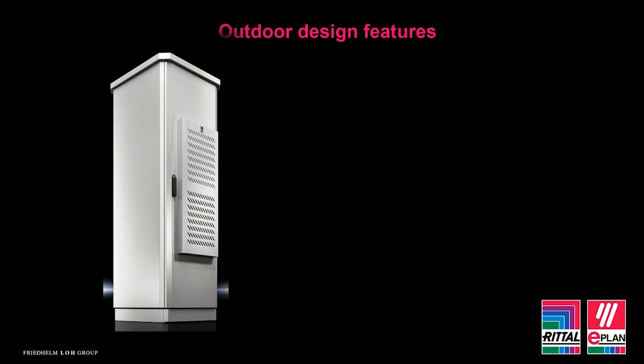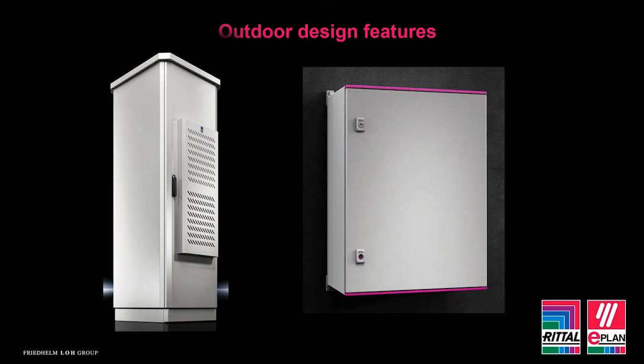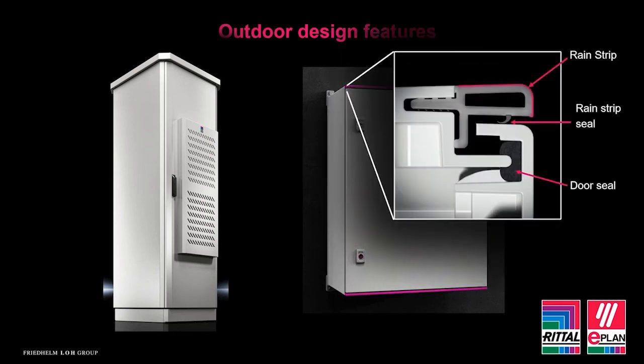On the image on the left, we can clearly see an overhanging roof that will protect the door seal from sitting rainwater. On the image on the right, we have a wall-mounted GRP cabinet. This cabinet has a rain strip both at the top and the bottom. This allows the enclosure to be turned through 180 degrees with the same level of protection. And we can see from this image, it has two seals, one below the rain strip to the enclosure door, and then another seal against the main body of the enclosure. Now, this labyrinth effect gives a high degree of protection. Both these types of rain protection mean the seals will work as they intended and keep the IP rating intact.